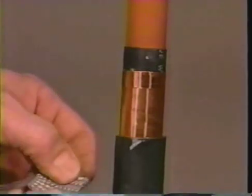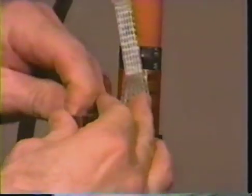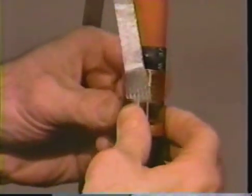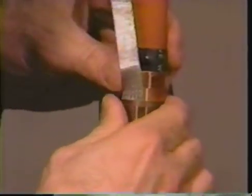When working with a copper tape or LC shielded cable, you should now install the ground braid. Flare the moisture blocked end of the ground braid and place it onto the metallic tape butted up to the cable jacket. Attach the braid to the shield by placing two wraps of the spring clamp over the braid and shield, then bend the braid back over the spring.